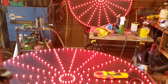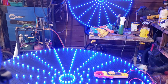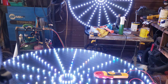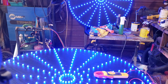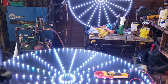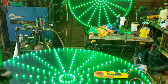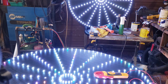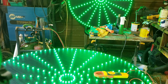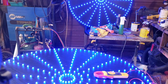I've gone ahead and hooked up two mega spinners together for a total of 480 pixels off a single port. The line coming in is 25 feet and then I have a line from the first mega spinner to the second one. I'm still running at 75% and you'll notice on the second mega spinner I have the dreaded flicker all over the place that we all hate. Normal wisdom says you need to add power injection. But if that were truly the case, that means at the end of the line I would have no voltage — hypothetically. Let's take a look.